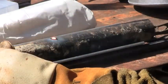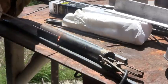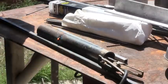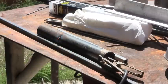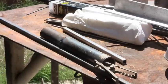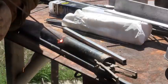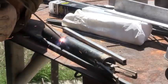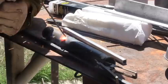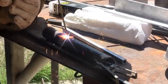So here I'm tack welding it. This is a 3/32" rod. I'm going to try a 3/32" because that's what the machine recommends, but I don't like the 3/32" for this because it doesn't seem like it has enough juice to penetrate through that paint, rust, and cement. But I'm going to try it. It's keeping a real weak arc and it's not penetrating very well.